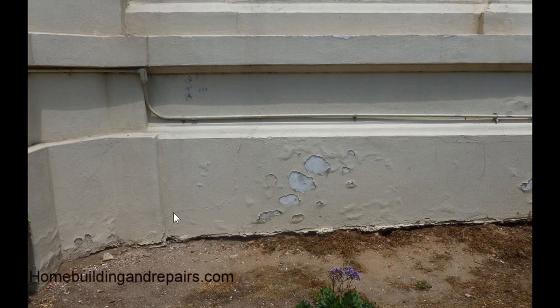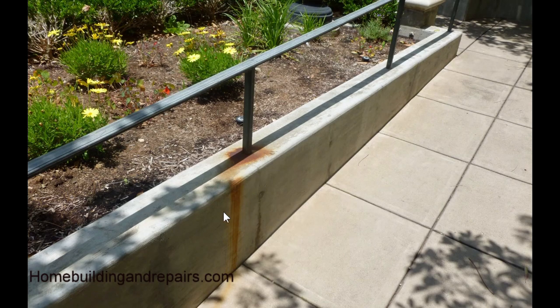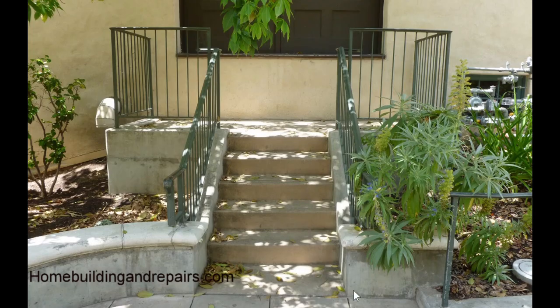You can actually see this is either a crack or an area where it's been repaired. It's not uncommon to see someone come in and repair something like this and then within a few years end up with the same problem because they're not doing anything about keeping the moisture out of the soil — or they cannot. Keep in mind also that concrete with metal in it rusts. This would include all the rebar. Lowering the soil or redirecting runoff — the more water you can keep away from these structures the better off you're going to be.